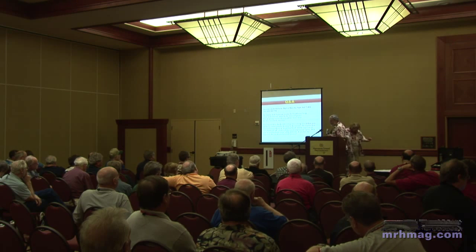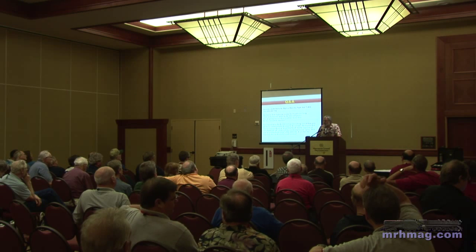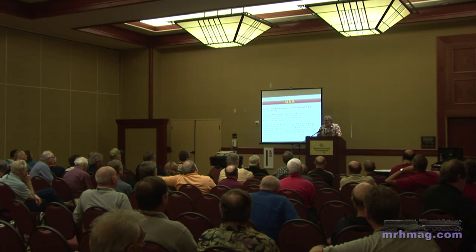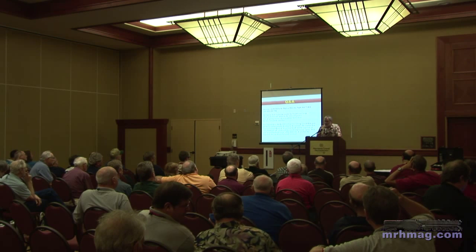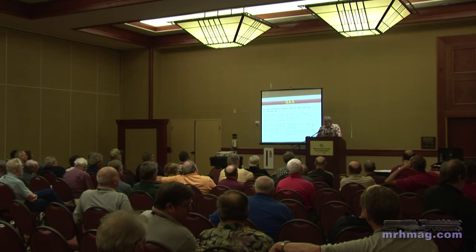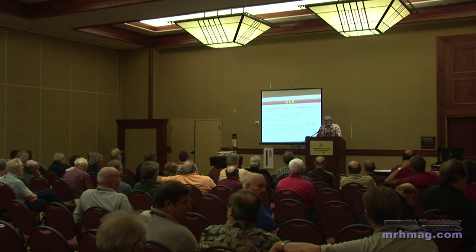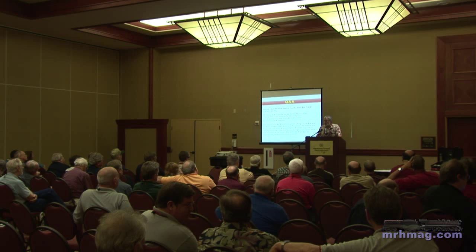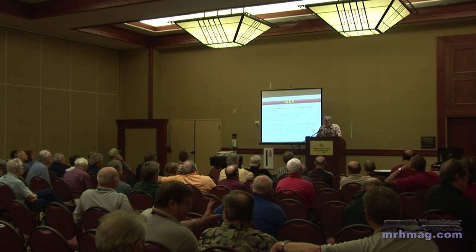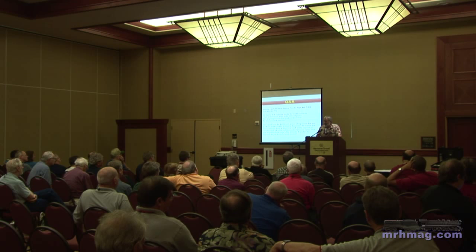Going over the 164D specifically: we looked at a number of units sent back, and when something unusual comes in I have a close look. The repair people go through and test to the original design specs — they all test fine. So they end up at my desk. What it appears to be is that the SDH164D was designed to run with a 32 ohm speaker for various reasons. If you run it with a low-impedance speaker you can do that — it won't damage the decoder.